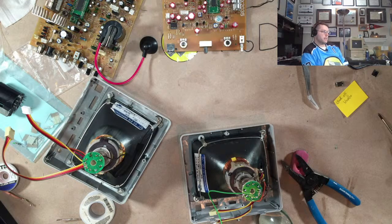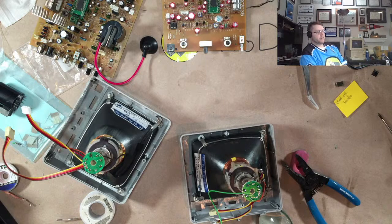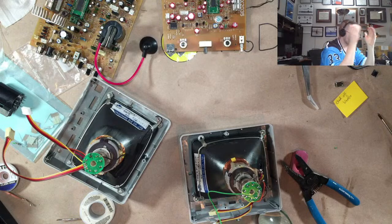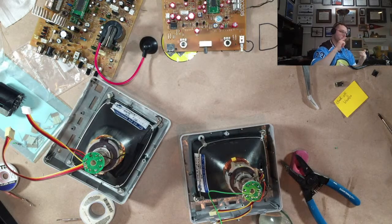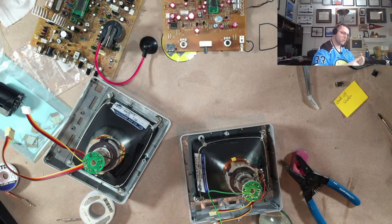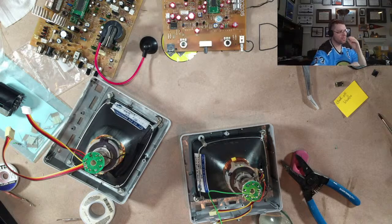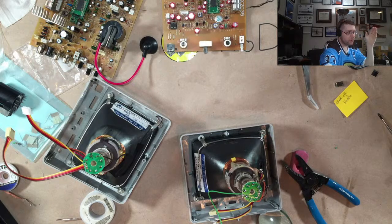I'm kind of a purist when it comes to stuff like that. There are exceptions, which we'll talk about in a section, but the nice thing about having an S-Video or AV-modded Atari is it just makes it easier to hook things up to the TV. One thing I found out when I was a little boy is there are limitations to hooking RF up. There was a time where I had the Nintendo, Super Nintendo, and a Genesis all hooked up RF, daisy chained one after another, because I thought, why wouldn't it work? But you just can't do that. The signal's just not there. So it's nice to have S-Video or AV. You can put it in a switch, and it just makes life easier using the systems.